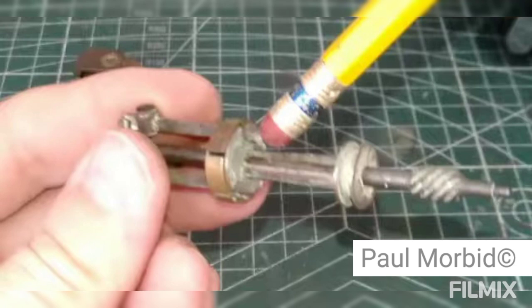And if you think your Bolex 16 or 8mm cameras are safe, well, they're not. They're made out of about 4 different types of metals, and they can be some of the worst. This is one of the Bolex cameras that I got in Southeast Asia. Someone stored it outside somewhere, and the governor right here, the rust and corrosion just started all over it, and has eaten straight through it and is totally irreparable. So even if you take it apart, it makes no difference whatsoever. The only thing to do in a situation like this is replace the entire governor.